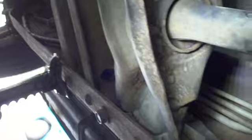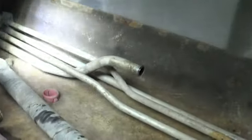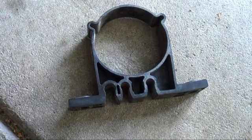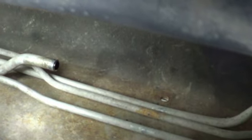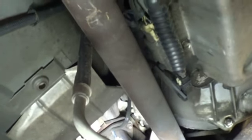That's the back of the car, rear wheel. That filter — we've cut that gas line with a tubing cutter. This is that cross member that goes across, so that fuel filter was held in with a bracket right here. That's the line going to the back. The line going up front is a steel line connected to a flexible hose. We've got that one cut with a tubing cutter as well.